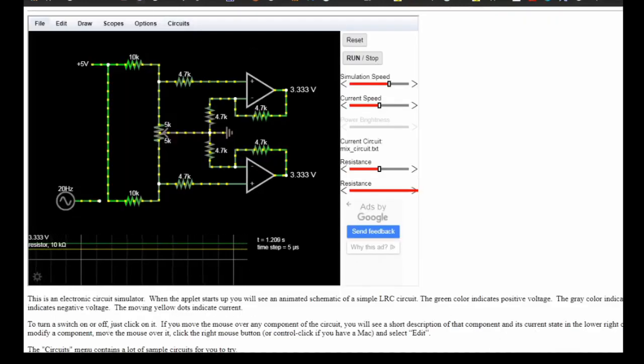So as I said, with this circuit you get 1.5 times the input on the output when you have it on both the most left and most right positions. When you have it in the middle, you will get exactly 0.5 of the input signal. So this is a very nice circuit if you want to use it for panning, although with a bit of amplification.